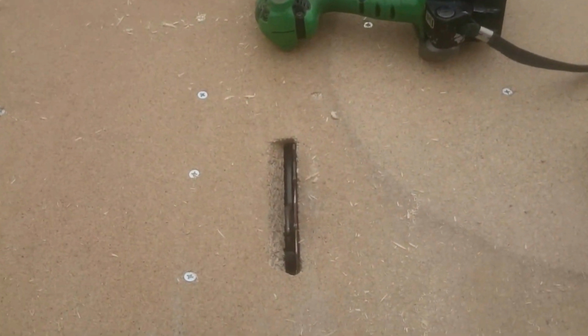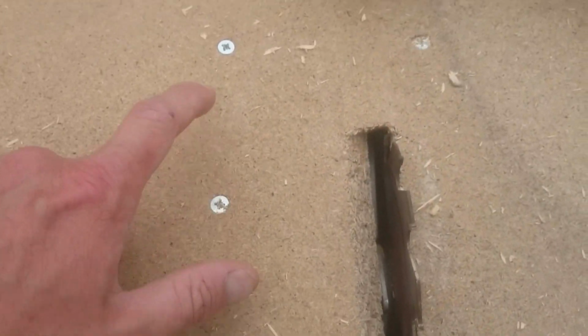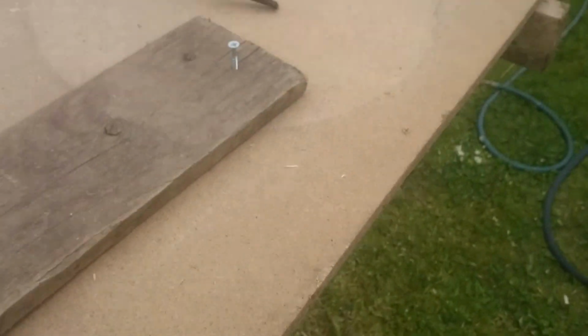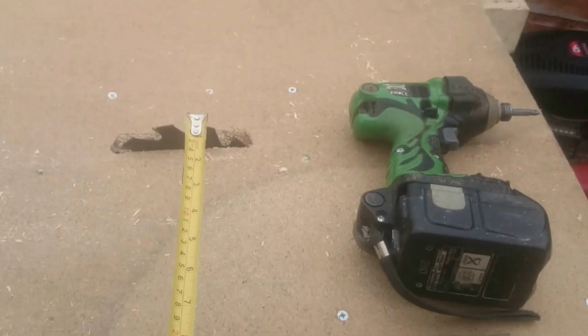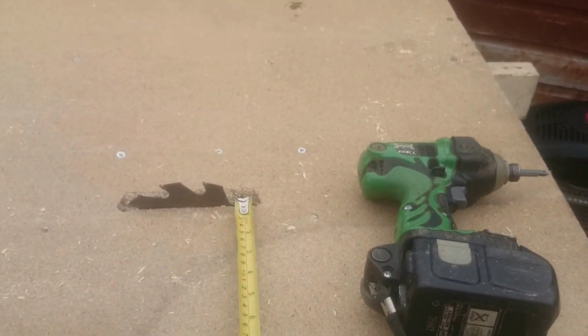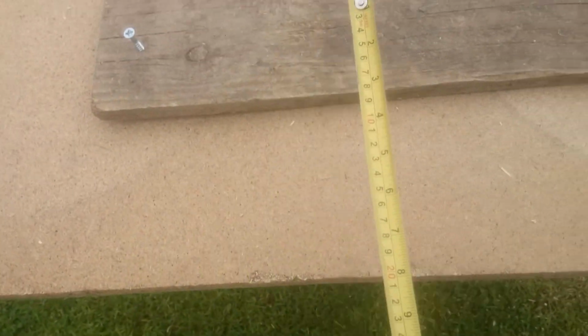And now to the fun part, the circular saw of death. Okay, so these like 5 screws go down through the board into the base plate of the circular saw that holds it up nicely, and then I measure from the disc to my guide bit of wood, and I screw that down into the board. Obviously this is not a permanent fix, this is something to get me by for a minute or two whilst I'm working out what else I'm going to do, but it does work.